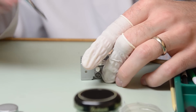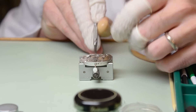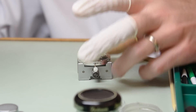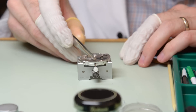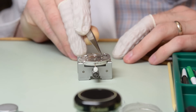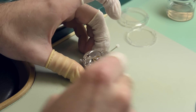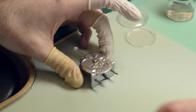So you take out the screw for the ratchet wheel, and then also the crown wheel here. This wheel actually has a reverse threaded screw — it's a left-handed screw — because if it were the other direction when you wind the watch it would actually have a tendency to want to unscrew the screw. And if a screw comes out while the watch is operating it's basically going to stop functioning. It can cause some serious damage having parts floating around in there. Basically from a customer standpoint if a screw comes out of your watch it's going to stop and you're going to bring it back very upset.